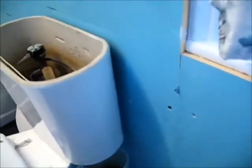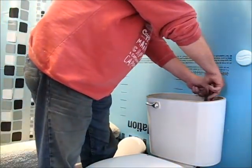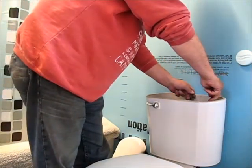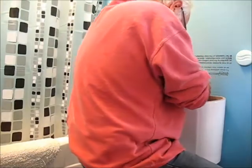I think I've got some plastic bolts upstairs from toilet kits somewhere along the way. I'll reach this over in the back there and see if I can snip that bolt off. I don't even think it's the gasket that's gone bad. I actually think it's been leaking right out of that bolt hole right there. So, let's try this.